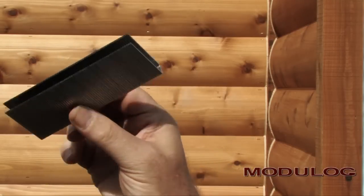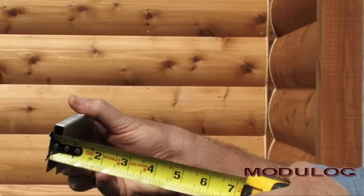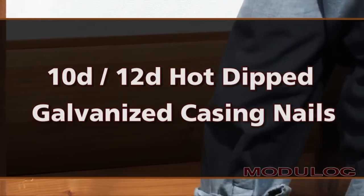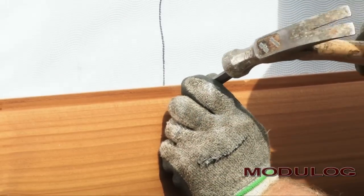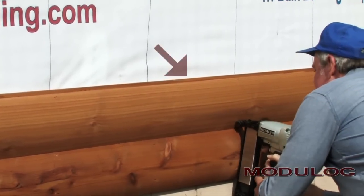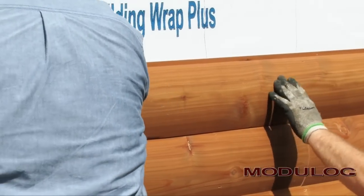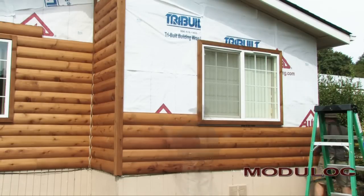For fasteners, use two-inch stainless steel staples with a seven-sixteenth inch crown, which requires an air compressor, but the time saved is well worth it. The advantage of staples is that when the crowns are driven lengthwise with the grain of the wood, they virtually disappear. 10D or 12D hot-dip galvanized casing nails can be used in place of staples, as their heads leave smaller holes than common nails or screws. Nail clips are available for use with an air compressor. Two fasteners are driven into each stud — one near the top and one near the bottom. Butt joints are staggered at least two studs apart and should fall on a stud using two fasteners at each end of the siding. When installing over a substrate at least three-quarters of an inch thick, it is not necessary to hit the studs, and a smaller nail size is used.